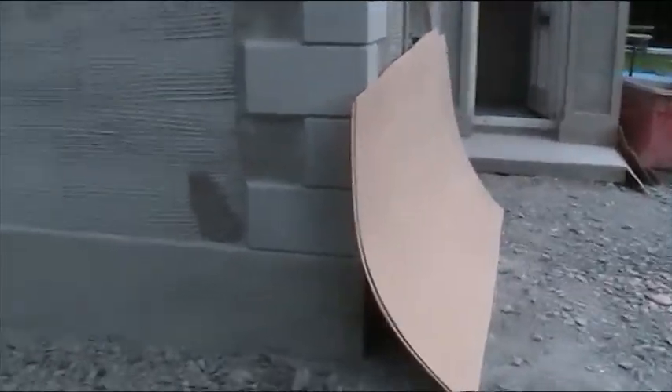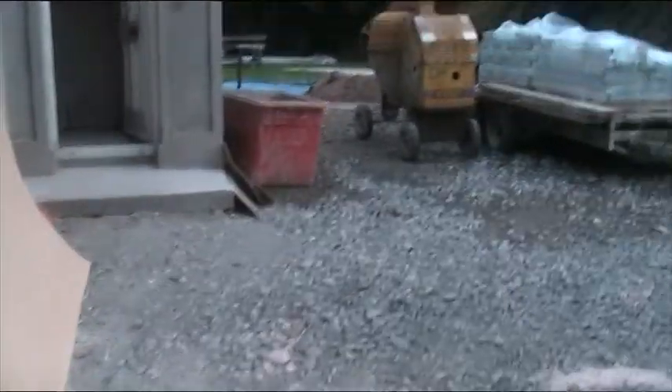We could move stuff back into the front room but we're going to wait. Shimmy said you can get the carpet down before you put the skirting boards on and it looks a really tidy finish - when carpets are turned over at the edge there's a wee bump he doesn't like. So get the carpet fitted and then put the skirting boards on. If you ever change the carpet it's just a matter of pulling it out and sliding a new one underneath.